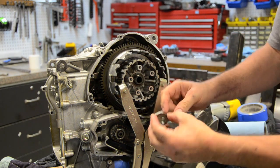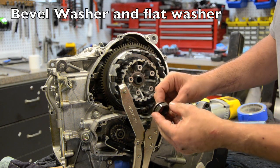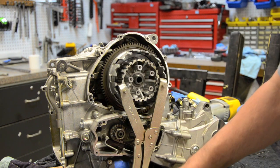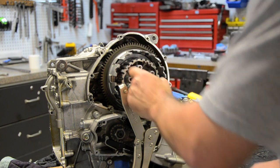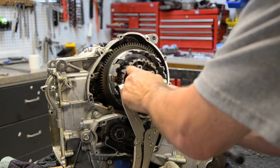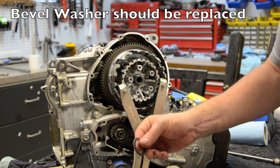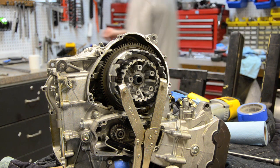The nut actually has a collar on the inside. There's also a washer — I'm going to double check that. I imagine that is the way it came off. There's another washer — keeping these lined up. There we go. That's a bevel washer, it's got the bevel on the outside. I'm going to zip tie those in the order they came off so I know exactly how to put them back on.